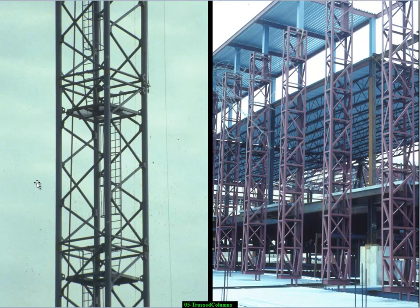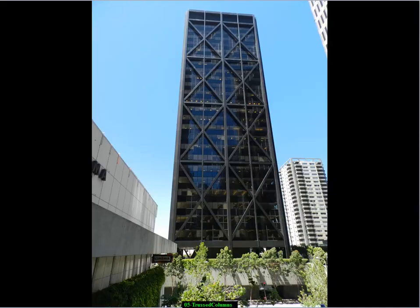Here we see it at the scale of a fairly localized column that might be 5 or 6 feet on the side. Here we see an alternative view of that. We can also do this at the scale of a building. So here again, you see the notion that everything at this level is stabilized against moving that way by these tension elements and these compression elements. And then everything at this level is stabilized relative to that level by this cross bracing.